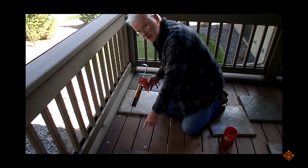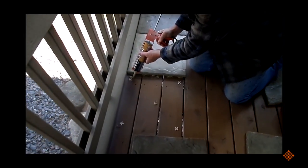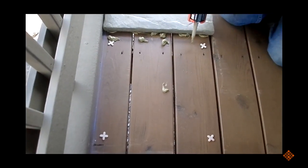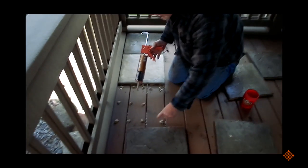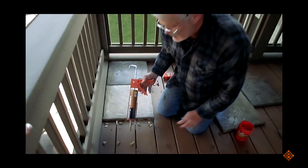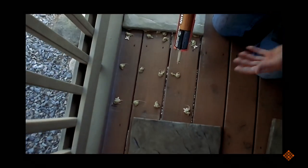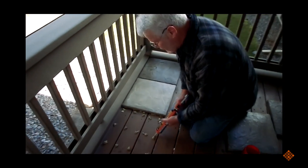Since we put the spacers down we have to put a little bit more glue on it. We don't want to get too far from the edges with the glue — we want it to catch on the outside. So I'm putting it in piles versus running a stream so that it sticks up a little higher to overcome the height of these little spacers. I'd normally just run a line along if I had a joist, but since we're going over this decking I'm putting bigger piles. I'm also putting a layer in the center since we have support there — might as well use it to help hold the tile.